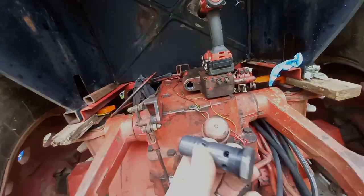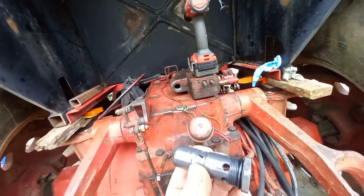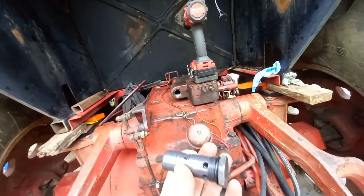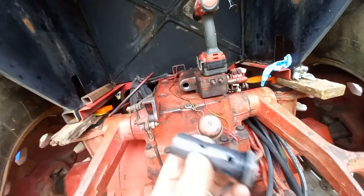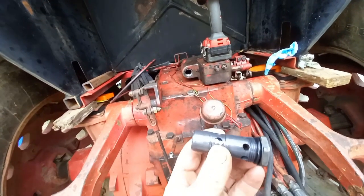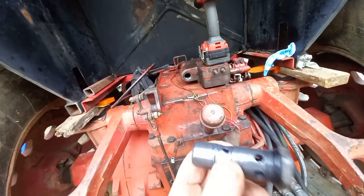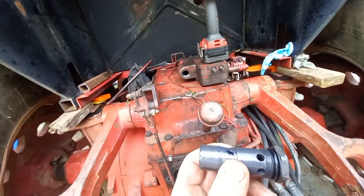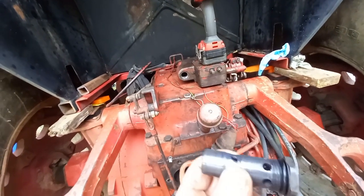It was factory staked. I've got this thing cranked in all the way. I was trying to see, would cranking in the relief valve raise the pressure? Would the pump respond to that? And it didn't. It's Joe at Red Run Right. Great guy, helped me a lot. Thank you to Joe. He was the one who warned me, you better watch out on cranking this thing up because it'll give you enough relief pressure to snap either the gear or the keyway or potentially the pump shaft.